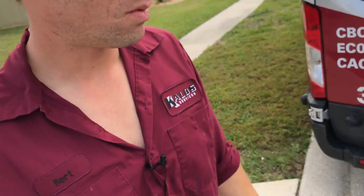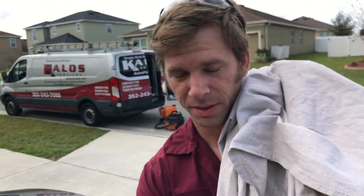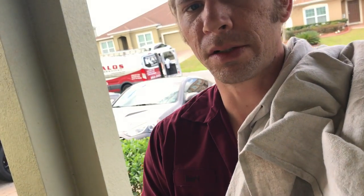So these wonderful customers have a dirty coil, and I mean really dirty, right? Yesterday, these people had their coil cleaned by a company, and it's still really dirty. What happens is the float switch is clogged when I show up here this morning. So I get a call: float switch is clogged, unit's not running. He cleaned the coil, overflowed to the float switch, and left it not working.